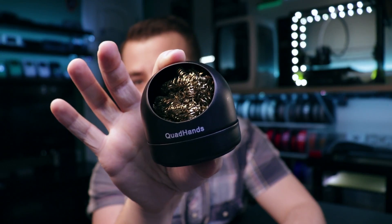Next, a couple of things to help you take care of the tip of your soldering iron. As you're using it, you'll need to clean the tip periodically as it accumulates excess solder, burnt flux, and things like that. The best thing for doing that is one of these that I showed earlier — you just kind of stick the tip in there and wiggle it around and it cleans all that off, nice and simple. Some people just use a wet sponge, which does the job, but the problem is it will cool down the tip of your soldering iron and it'll have to reheat after you clean it every time. I've also heard that can decrease the life of your tip because it's constantly heating up and cooling down through that cycle.